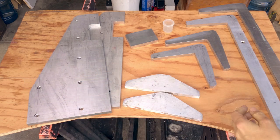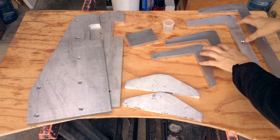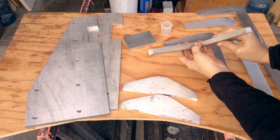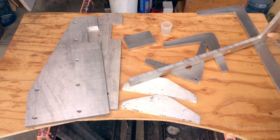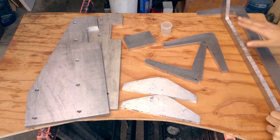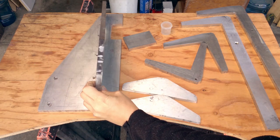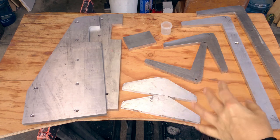My thought is to do the next work on these. These parts have a milled edge here, and the only thing I have to do is trim the corner and make sure it doesn't get in the way. These are a different story - I've got to make this entire surface flat and make this corner square. This is fairly critical - this holds the machine into being square. The first thing I can do is probably round the corners and get a little work done on the edges. I tend to try to get most of the heavy work done first and then work towards the fine work.